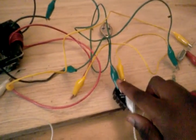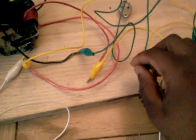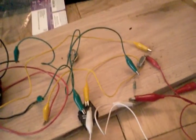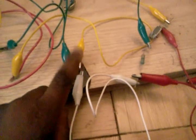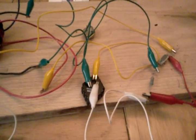Oh, this right here is also going to our feedback coil, just like this little cousin over here. Just going to show how this all works. Well actually, this is the base, and that is — not the emitter, but starts with a C. Can't quite remember, but anyway — our collector. So that's just going to go there.